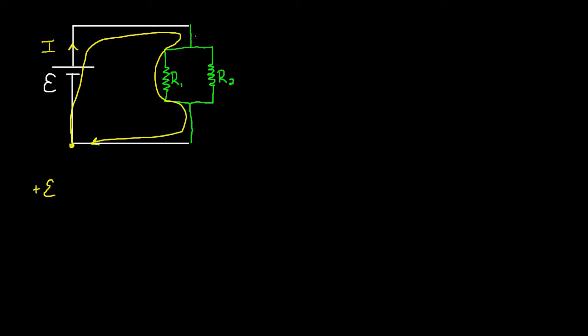So this time, current flows out of the battery, and then some goes this way, and some goes the other way. So you've got current splitting off now. The total current that came out of the battery comes over here, and now there's a junction. So the current that came out of the battery is going to split off two ways. It won't necessarily be equal in both directions. If these resistors have different resistance, it's going to split off in a different amount. Whichever resistor has more resistance will get less current. That's counterintuitive, but it makes sense. More resistance gets less current. A lot of people think, oh, bigger resistor, better resistor, more current. But bigger resistor, more resistance, less current. So whichever one of these has more resistance gets less current.